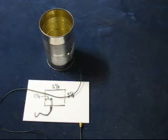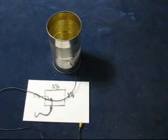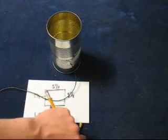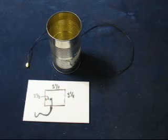Well, here's another good tip. Buy yourself a wireless access point. Put your antenna as high as possible in the house. Maybe in the top floor or in an attic. Maybe there's a port or a hole in the attic. The signal tends to get attenuated when it has to travel through too much wood or shingles or whatever. And if you saw my other video, I have a port in my attic where I can place the antenna, and there's like a plexiglass window, and the signal is not attenuated as much, and I get a pretty good signal that way.